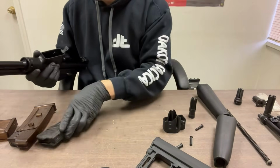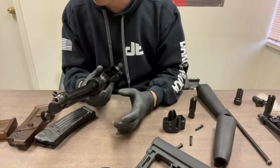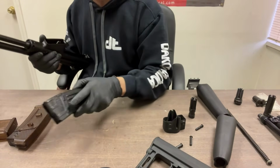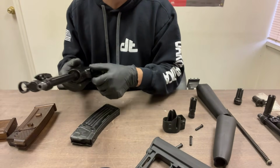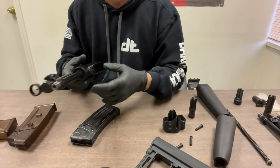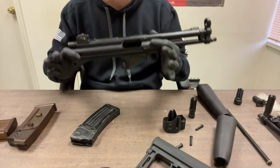Now, that is repairable. We have a mandrel we can stick in here. We can restrike the mag well, get it to the proper shape. It should balance out and fix magazine issues. That's not an expensive repair, but it could mar up the finish depending on how physical we have to get with it. So, again, that's another thing to be mindful of.